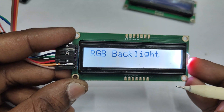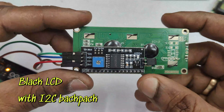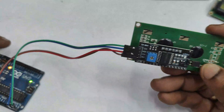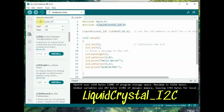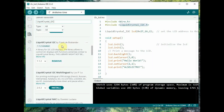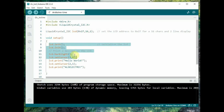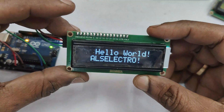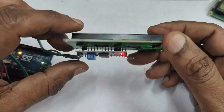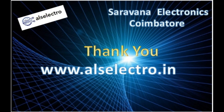In this way you can give an attractive look to your LCD. The third one is the black LCD which has an I2C backpack — a regular I2C backpack using the PCF8574 IC for I2C protocol communication. Here the library is LiquidCrystal_I2C — install this library, as it is different from the AIP31068 library. The I2C address of the backpack is 0x27. Upload the sample code and you can see the display on the LCD: it has a black background with white display, attractive and good brightness. All these modules are nice and you can use them in your project. Thank you for watching.